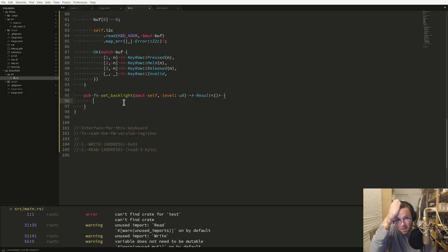This also bit some other people at Ferrous. There's a gas sensor, I think it was the Sensirion one, and we were trying to interface to it from an nRF52 and it just wouldn't work. Eventually we realized it was this bug. I think in old versions of the code it didn't even report an error when it happened, because the DMA gives you no feedback that you're trying to DMA from flash, which is annoying. But yeah.